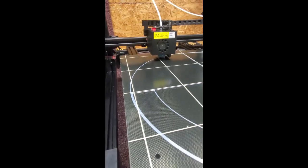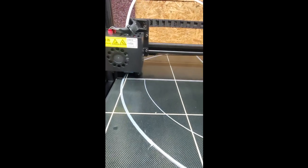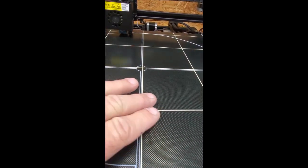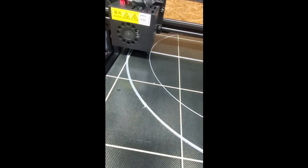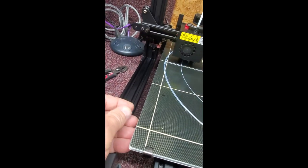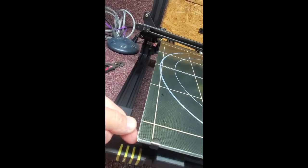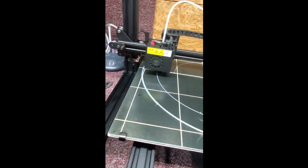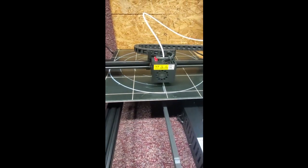The initial test print — just to test the tolerances, make sure it's the right height, bed leveling test, whatever you want to call it — looks pretty good so far. Everything looks to be pretty close to the bed, right where it's supposed to be. It looks good. It's centered, it's the right height, it's the right thickness. It does go off the bed out here, so I'm thinking that what people do is put a wipe relief out here — basically a little thing you stick out here with a felt piece on it. So the nozzle comes over, wipes itself off, and then goes over and starts printing. I'll probably do something like that too. It's nice to wipe the tip off — otherwise you get a little bit of a blob.